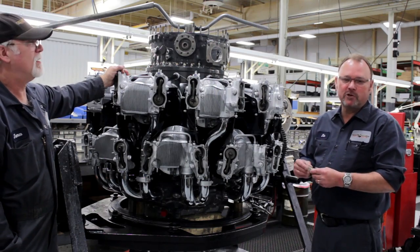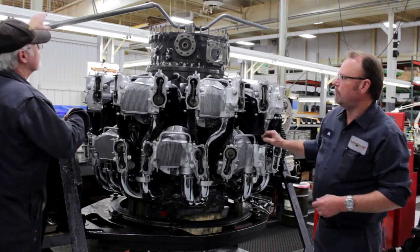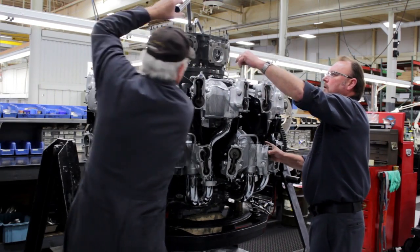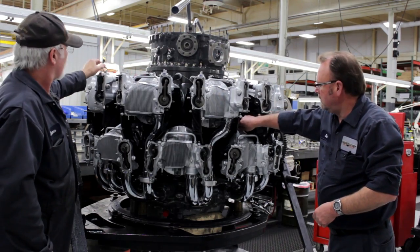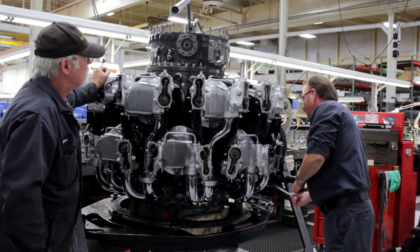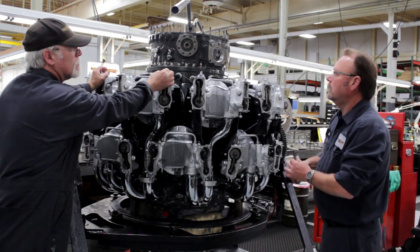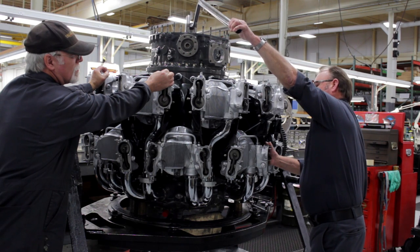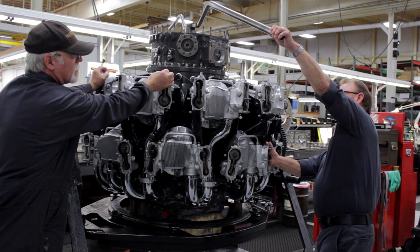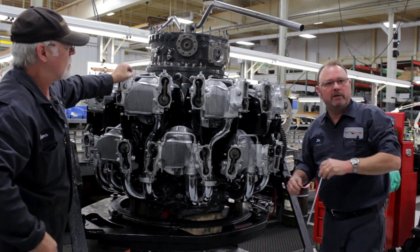The preferred method of Precision Engines is to apply a fabricated whistle into the spark plug boss and rotate the prop until you hear the whistle. Remove the whistle. Apply a screwdriver touching the piston and also slightly bring the screwdriver to the top dead center of rotation. Now you've established this and you're ready to set your valves.